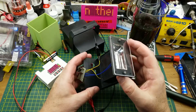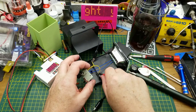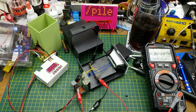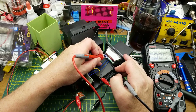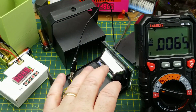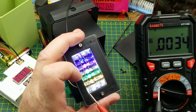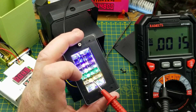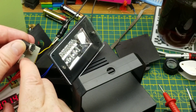What else can we tell about this thing? We could change the LEDs as long as they're all matched voltages. We could also find out what the forward voltage of those LEDs is - I'm going to guess right around 3 volts. Let's turn it up to full again and measure. 3.0 volts exactly. So those are essentially white LEDs internally with just different colored phosphors on them. That's kind of neat. I'm assuming these are reds and greens on this end - I'm sure somebody will correct me - but that is the technology that's always been used for blues and whites.